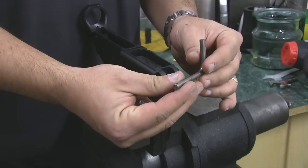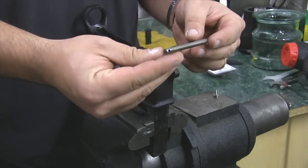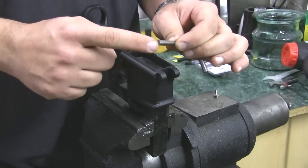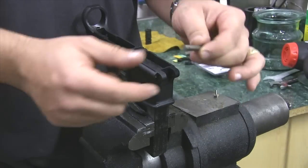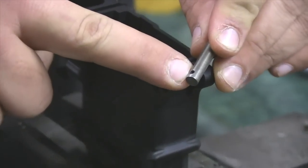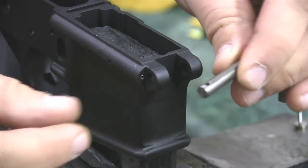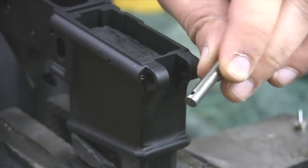To make one of these tools is pretty straightforward if you don't want to go out and buy one or if you're looking to do something in a pinch. Basically this is a quarter-inch piece of bar stock that's got a little bend in it, and there is a 3/32nd size hole drilled through all the way, close to one end but not all the way at the end.